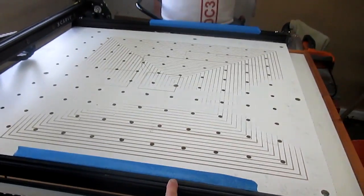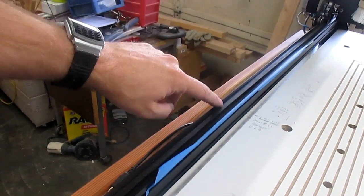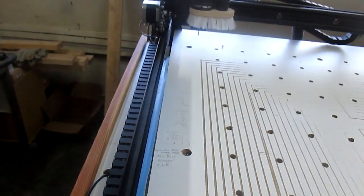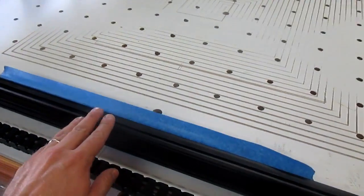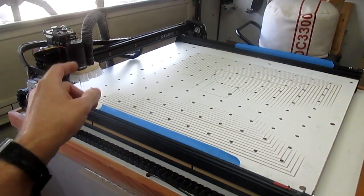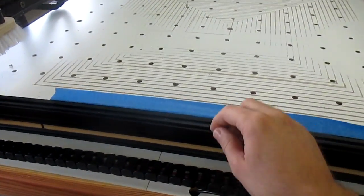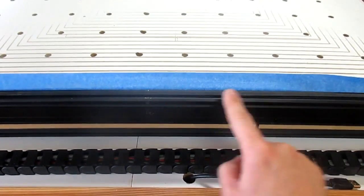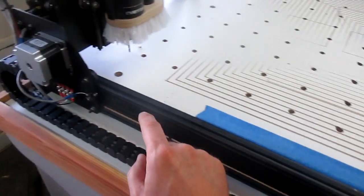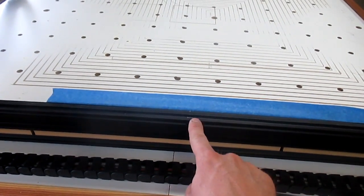You'll see that I have some tape on the rails here. I put that on there basically to keep some debris and chips from flying up onto the belts in the areas that I most commonly use the X-Carve. You don't have to do it, but it can help prevent belt damage or dust buildup on the belts. Notice that I start with my X-Carriage and gantry all the way back in the back left corner — I do that to get the longest belt spans that I can. I have all three rails marked where the center line is, between where it's tied down and over on the roller wheels themselves.